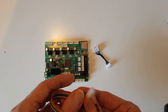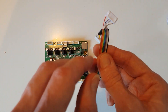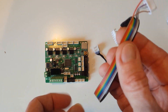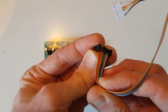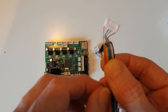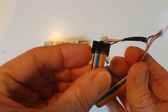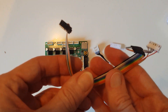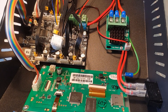For the touchscreen LCD I ended up modifying the existing ribbon cable. If you look at the main board, the direction this plugs in is different than it is on the V4.2.7 board. What was pin 1 and 2 on the original setup is essentially reversed on this board - so the brown and the red now make up the 5 volt and the ground. Note that brown is actually the 5 volt and red is the ground, so don't pay attention to the colors. The RX and TX pins are similarly switched around.